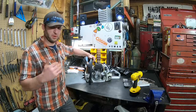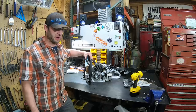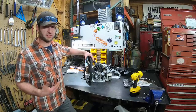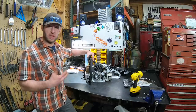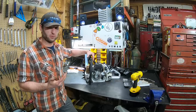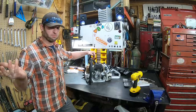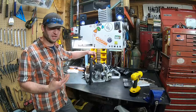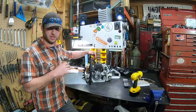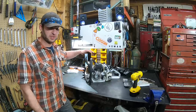I still need to do some more reading. My buddy Pat did some research, and sometime around 2010 they modified the 880 to make it more EPA compliant — from what I understand, they pretty much handicapped it quite a bit. I don't have a lot of experience running big saws, so I wouldn't know the difference. But once I get it broken in, I'm going to mod it: apparently you throw a coil from a 441, a carburetor and intake boot from an 088 or 084, and mod the muffler, and it opens these things up quite a bit.